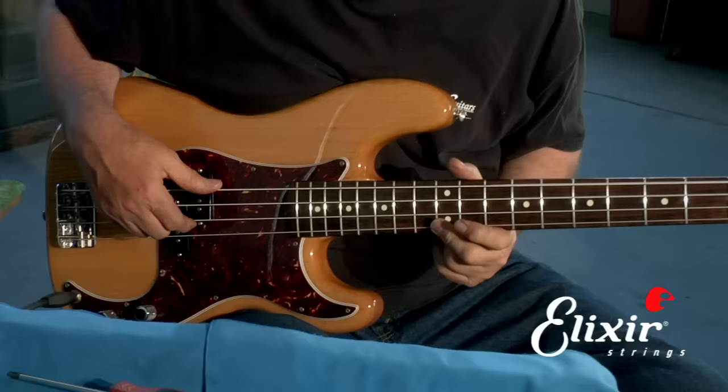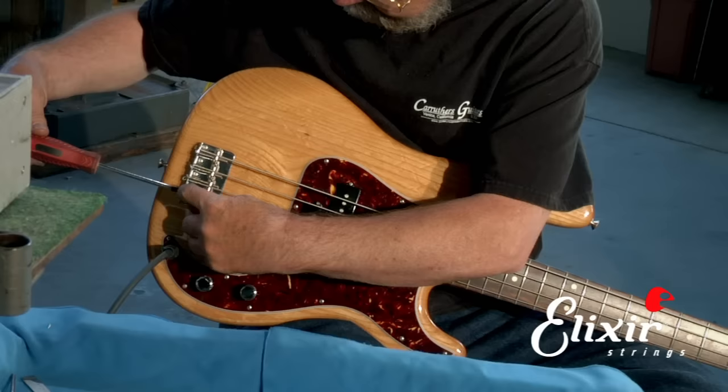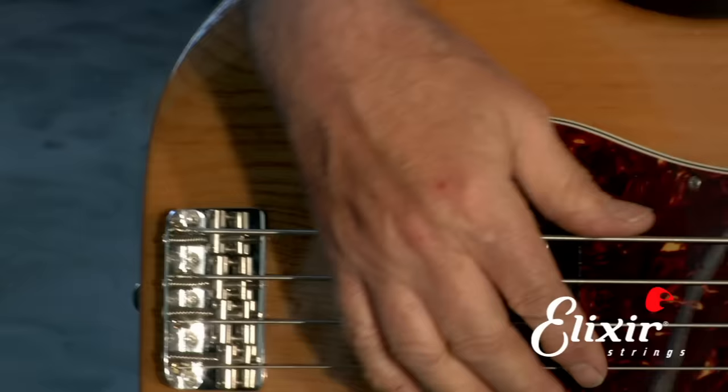And if it's in, fine. If not, then we would have to make another adjustment until we get it exactly right. Now, sometimes when you adjust it, the screw doesn't travel all the way. I always make a point of palming the screw with my hand like that, and that makes it so that the saddle moves and that there's no slack.